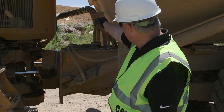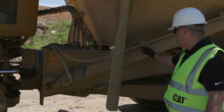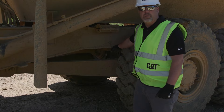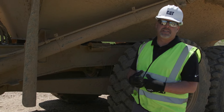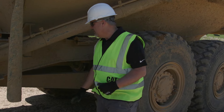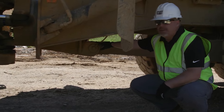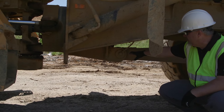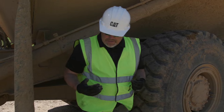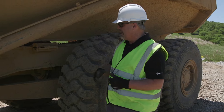As I come around, I'm looking at my hydraulic lines going through — I want to make sure all my bolts are in place and tight on my lift cylinders for my bed. Right inside this A-frame is my parking brake. I want to look at that disc and make sure it isn't seized up, doesn't have any rust on it, and make sure the pads are making contact. I also want to look at the hitch back here and make sure we're taking precautions with proper lubrication on the connection point of our A-frame. If they don't get lubricated, they start to wear out and I'll start to feel the bed and cab slamming back and forth — that's a good indication that the bearing and bushing is worn out.